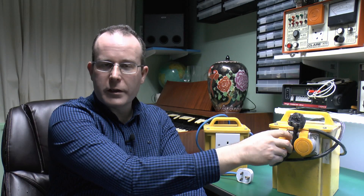While we're on the subject of transformers, it's worth pointing out that these building-site type units are not isolating transformers. You've got your 240-volt inlet here on the plug, and then the outlet is 110 volts. It's centre-tapped to earth, so effectively you've got two lots of 55 volts on the two terminals.